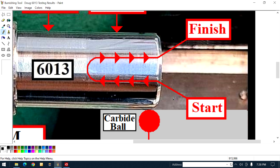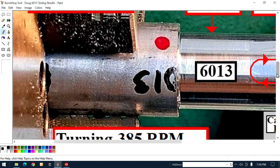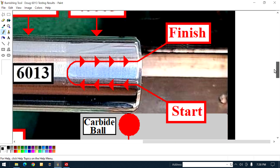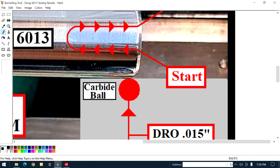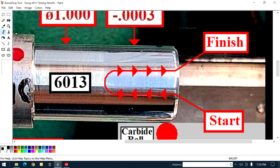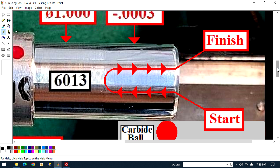Now the ball is off the piece. You're gonna put the power feed on, which is 2 thousandths per revolution. So what you do: you're gonna go from right to left with the feed. You set your feed rate at 2 thousandths per revolution and you let it feed to your destination — see where the mouse is? At that point you stop, change the feed direction on your lathe, and it comes out at 2 thousandths per revolution. When it's out, you are done.